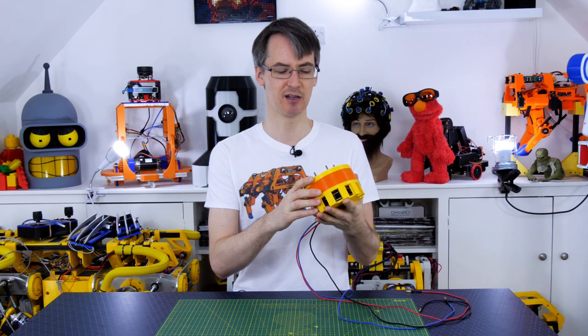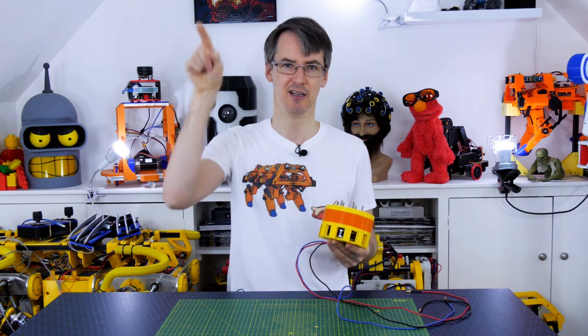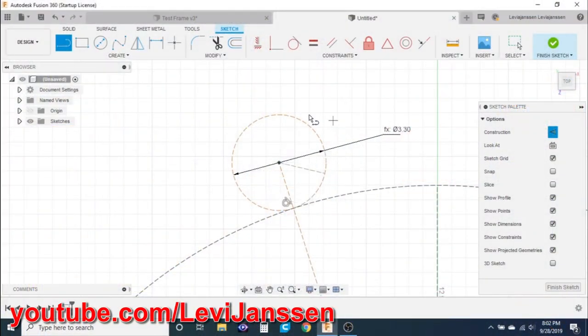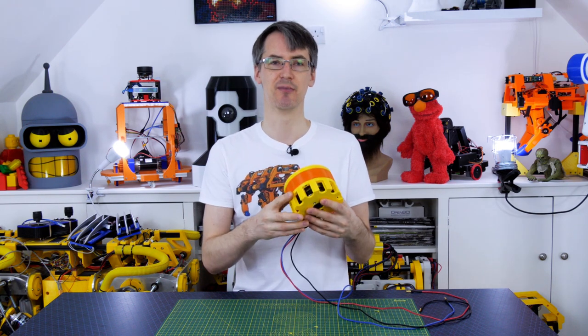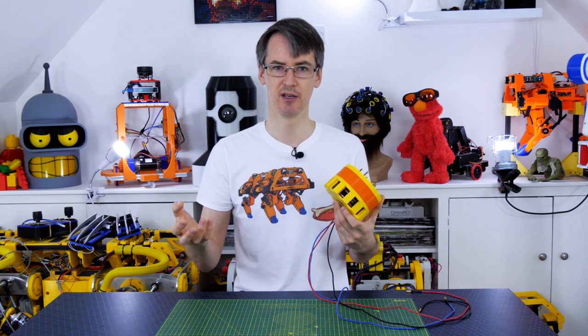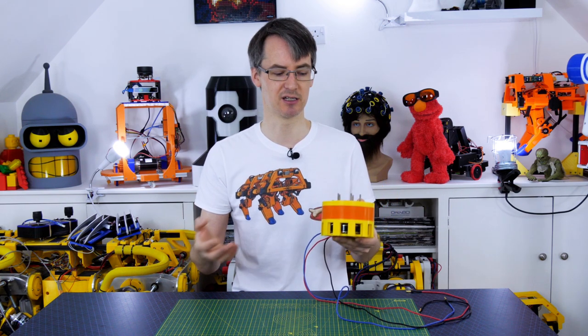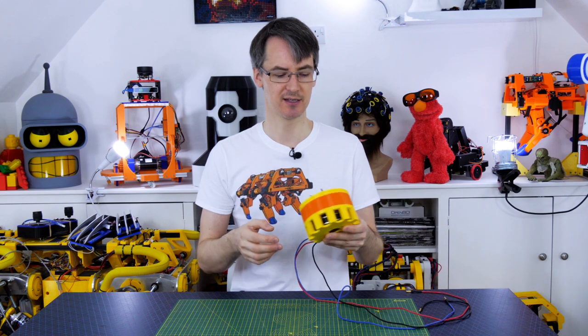There are several improvements we need to make to this design. Several of you have pointed out the cycloidal discs aren't the right shape, because I approximated them by putting lots of cylinders in a circular pattern and rounding off the edges. Check out this video by Levi Janssen who actually explains how to do it properly, and I'll refer back to that in future more refined versions. This design is full of bearings which makes it quite heavy and costly, so I plan to replace those with bushings, probably on shoulder bolts — using nylon or similar material — which will remove quite a lot of mass. This is open source, and if you'd like to support me through Patreon or YouTube channel membership, those links are in the description — patrons and members can get access to videos up to a week early, plus sneak peeks of what's coming up.